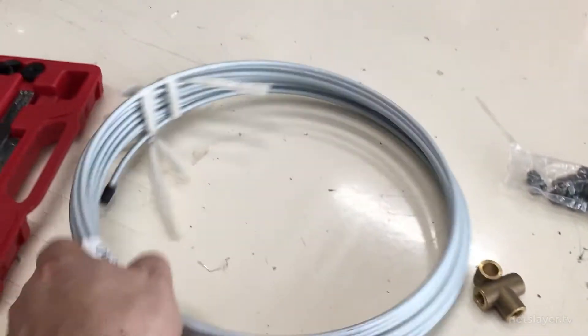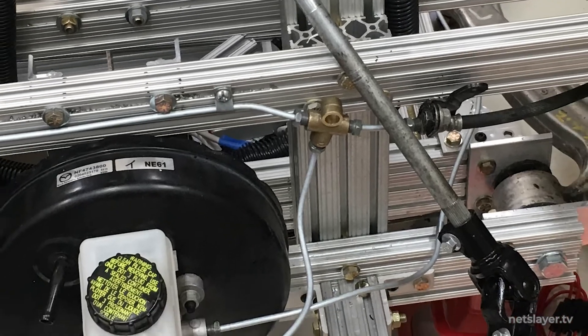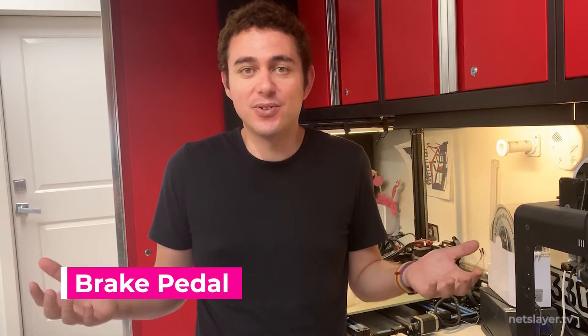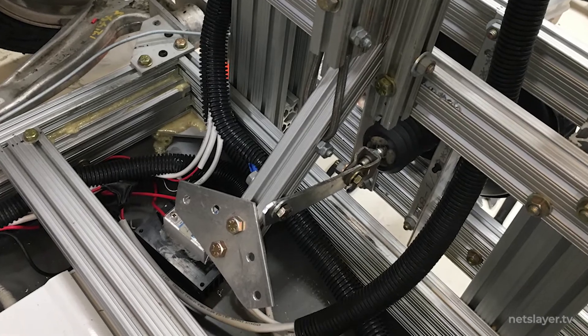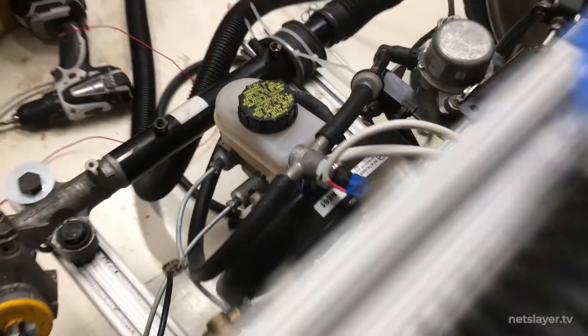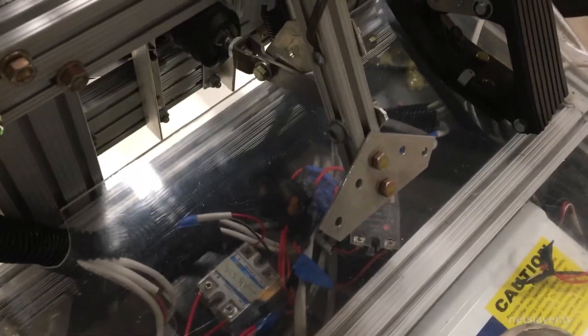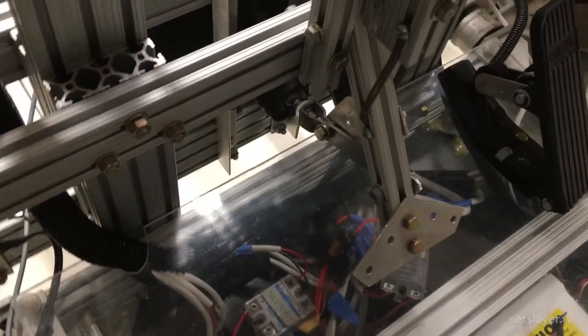It was kind of fun to bend all the brake tubing and crimp all those ends to a splitter back to the master brake cylinder. One important thing about brakes is you need a brake pedal, and I don't have one of those, so I decided just to build one. I used pieces from the old car, which I think was pretty fitting. I used a 90-degree bracket as the pedal itself and attached it with some springs — it came out really well, kind of artsy. When you press the brake pedal, you're pushing a push rod into the brake cylinder, which is under pressure and opens a valve. The air pressure then pushes the brake fluid through the brake lines to the wheel brakes, which clamp down and compress onto the rotors that we cleaned up.